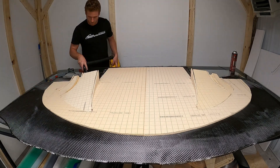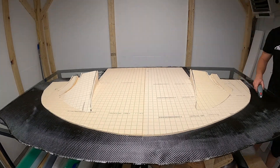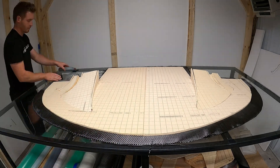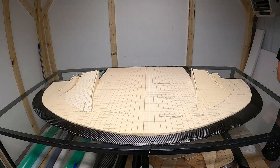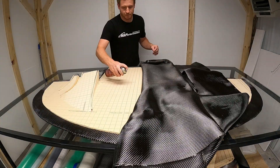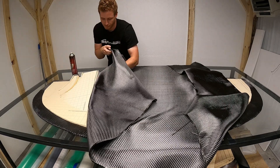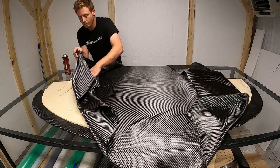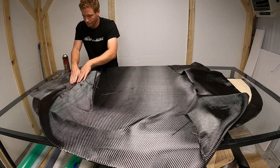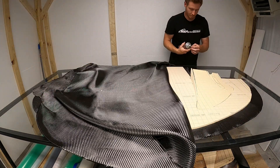Make sure you vacuum up all the strands that you cut off. Anything you leave in that mold will stay there - you'll be able to see it. If there are any strands underneath or on top of the mold they'll be resined right in with your part. Here I'm just laying up a top layer - sprayed some 3M adhesive over top and just start on one side and work your way out, making sure not to stick anything past where you're at.